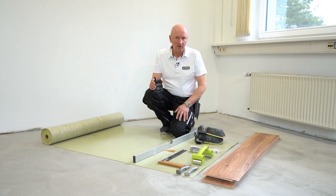The additional advantage during installation is that there is no waiting time. With conventional adhesives, after bonding you have to wait at least 36 to 72 hours until the adhesive has cured before you can load the surface. All this is omitted with our single glue — you can use the room immediately after installation, with no waiting time and no drying time. I can continue working immediately with a renovation effort that is almost zero.